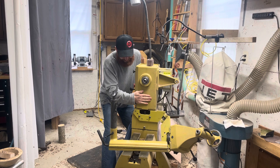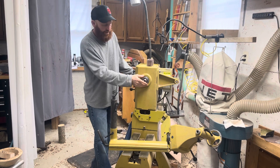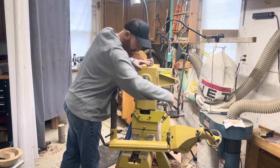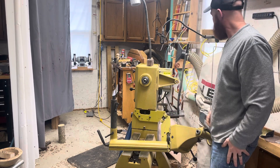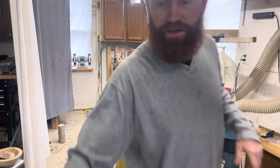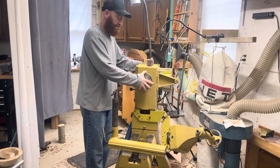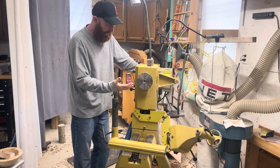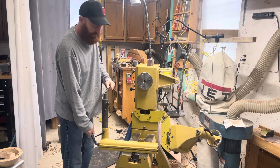That right there should be good — I think that's plenty. All you really need to do is make sure you're clearing out here with your faceplate and where your bowl is going to be. Then you've got to lock this back down, so I'm going to lock that down and make sure it doesn't move. Now I can put my faceplate on — I've got it over here. I'll do a separate video reviewing this faceplate, but it screws on. I've got a big bowl blank and I need to make sure it's not going to hit down here, but that gives me a pretty good distance.